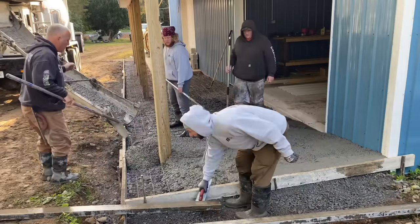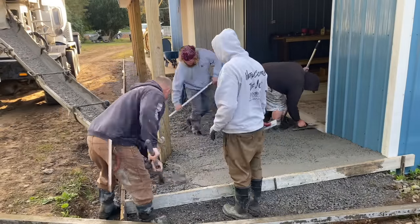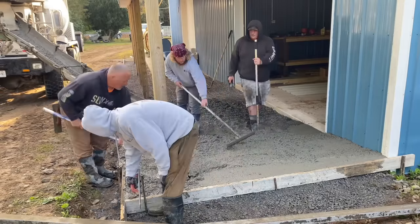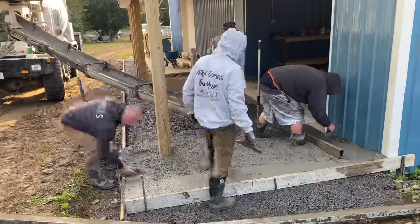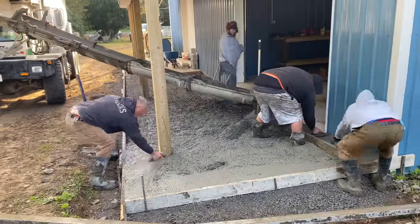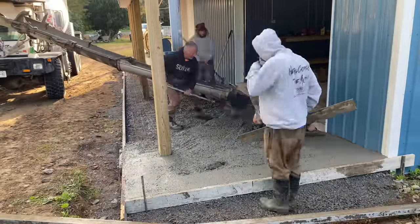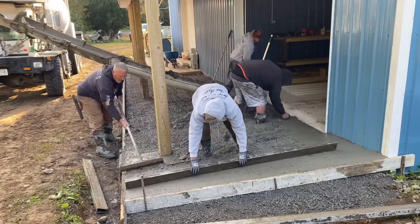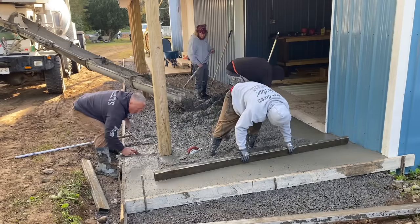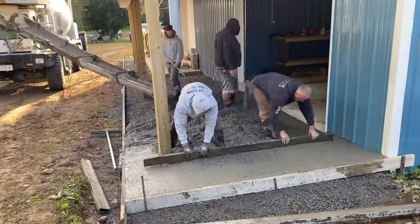Well, guys, you can see the difference in this mud here, how tight this is. It'll stack right up if you just watch how it pours out. This is probably like a good 4 slump. So I was exaggerating a little bit on the other mud being a 9 when I was just a little frustrated. This is about a 4. The other stuff was about a 6.5, 7 slump. Without doing a slump test, it's hard to tell. But it just wasn't going to work for this application.